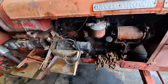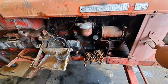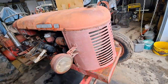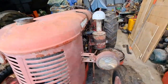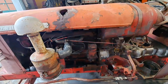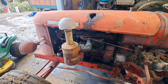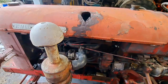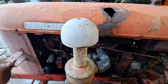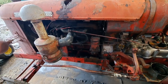I'm gonna pull these lifter covers off, see what's in there, pull the rocker cover off, see what's in there. Hopefully shouldn't have to go too far into it. I did, about 2 weeks after the cyclone, managed to get in, open the decompressor up, and fill the whole exhaust right up with oil, so it's not seized at the moment. So hopefully that's a bonus for us.